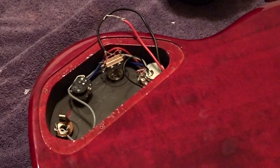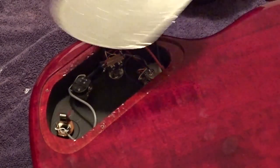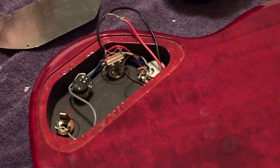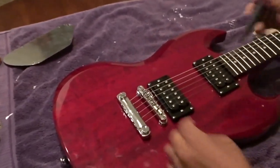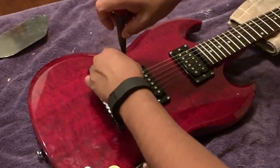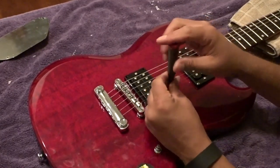What's with this little film on the inside of it, this coating? It is conductive paint and it makes the whole inside shielded, along with this shiny here. It makes it like a metal box — a Faraday cage — so it's all in a grounded box. Art's taking the pickups out now.